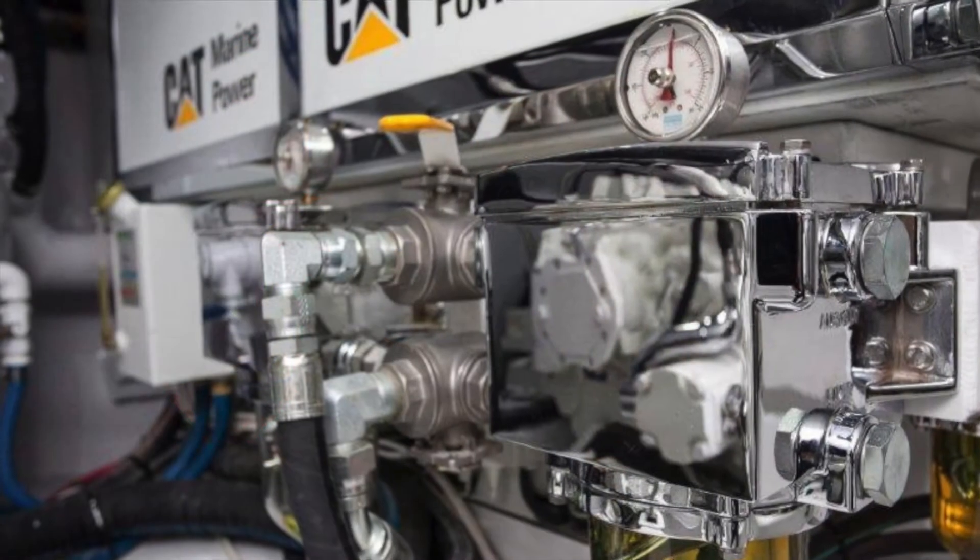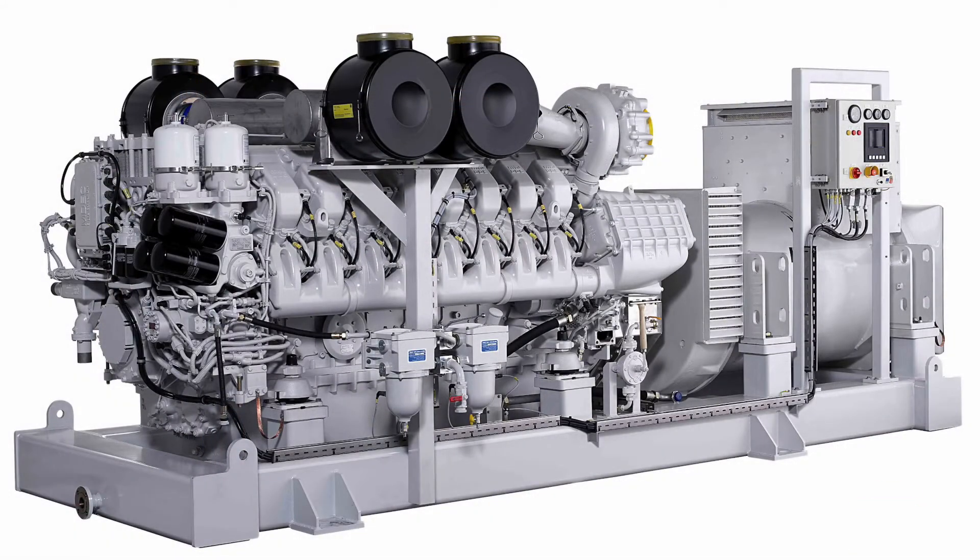What's the difference between fuel water separators and fuel polishing systems? While their functions are very similar, where they're utilized is different. Typically the engine manufacturer has already specified primary and secondary inline fuel water separators and/or filters. These are installed between the tank and the engine's fuel lift pump, essentially moving the failure point from the injector or injection pump to the fuel water separator. Rather than the water and particulate running to the injector, the failure becomes that the filter or separator is clogged. When that filter clogs, it directly impacts the engine's performance.